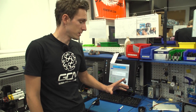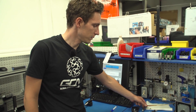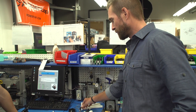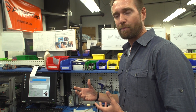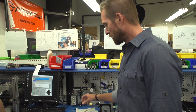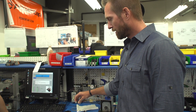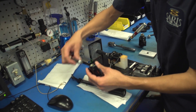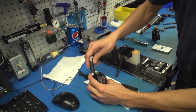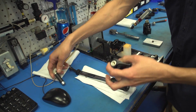This next step has been confusing me slightly — this thing here sounds remarkably like a vacuum cleaner. This is actually a vacuum. We do leak checks, so the internals on the pedal need to be sealed, and in order to test for that, we put this into the battery compartment and perform a vacuum check — basically a leak test on the internals of the pedal. So it should be sealed even in British weather? Even in British weather, yeah.